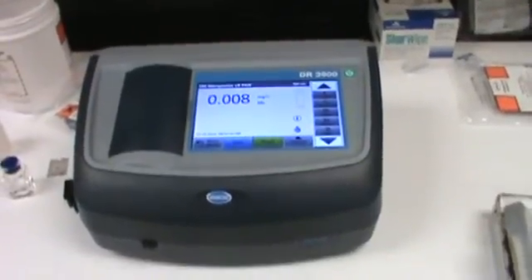That concludes our iron and manganese test here at Henry County Water Authority. We've removed 100% of our iron from the raw water — we went from 0.06 milligrams per liter in our raw to zero in our finished water. For manganese, we achieved a 75% reduction, going from 0.03 milligrams per liter to 0.008 milligrams per liter. So there's always room for improvement; we'll keep fine tuning as needed. Better numbers here means better water for our customers, and it's better for our distribution system too. Thanks.